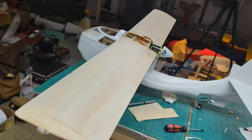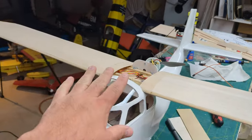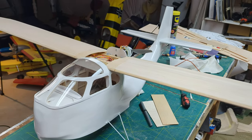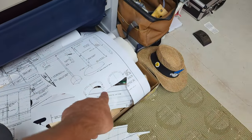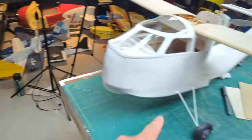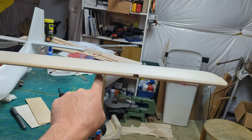Do some glass, fill the weave, and that'll be good. As I work on that, we'll have to do the nacelle — the nacelle is going to be a custom thing. We have formers on the plans that I still need to cut out. I still have the pontoons to build, struts that need to go from the fuselage up to the wing, and then a strut from the wing down to the pontoon. There's plenty more to build, but I don't have a whole lot of time.